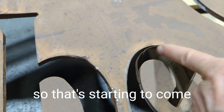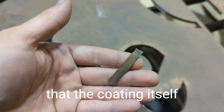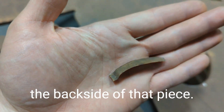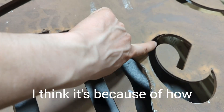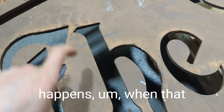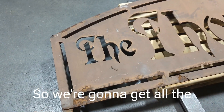Here's a good visual — that coating is starting to come off that edge right there. If we flip it over, you don't really see much metal, so the coating itself is just coming right off with not much mill scale on the back side of that piece. But again, it's one of those laser cut or plasma cut edges — the coating just does not like to stick to those. I think it's because of how hard the surface is and the chemical reaction that happens when the cutting action occurs with the gases involved.